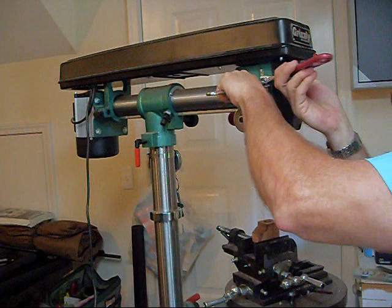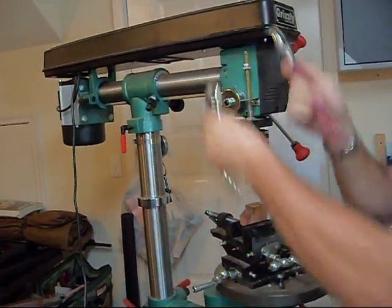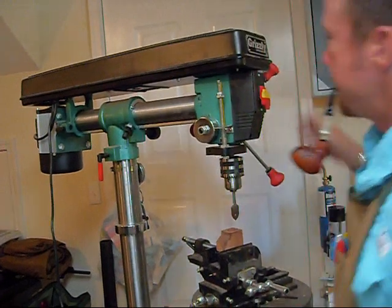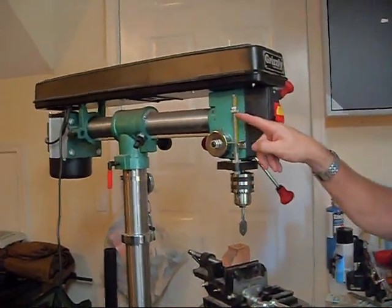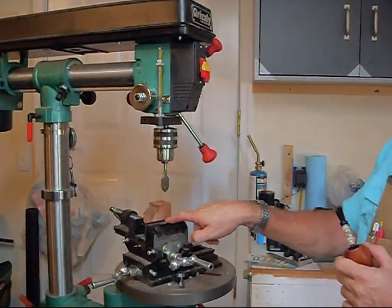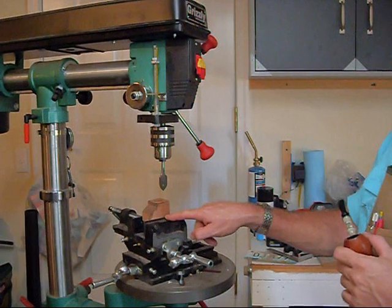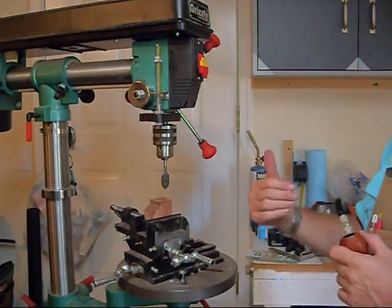That basically tells the drill where to stop at the bottom of the bowl, so you don't go through it? Yep. So what this is doing now is, when I get to this point, the drill press won't go any farther. And that will be at the bottom of where I've got the tobacco chamber and draw hole meeting. So it will stop at that point so I don't over drill.